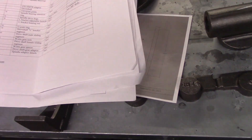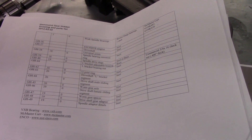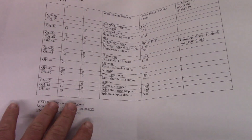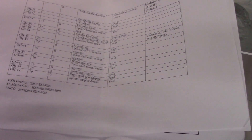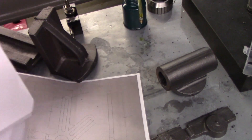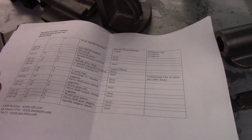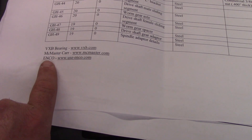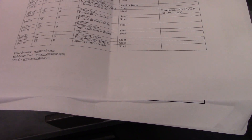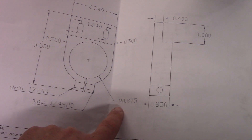This is the one and only time I'm going to show any of these plans, just to illustrate a point. You're going to get a list with all the drawings and part call-out numbers for McMaster-Carr and other places for parts you'll need to purchase. Depending on whether you have the stock for spindles handy, on top of that $500 you're probably going to spend another $200 to $250 in parts alone - just be aware of what you're getting into. The ball cranks originally came from Enco, which doesn't exist anymore, but there are drawings for the size so you can order them somewhere or make your own handles.